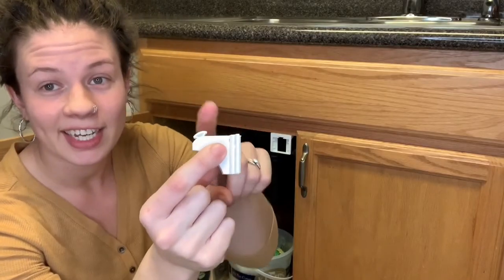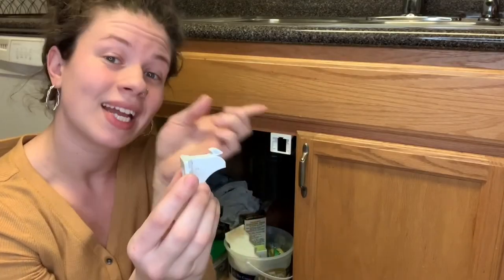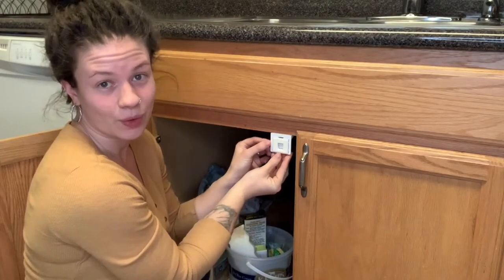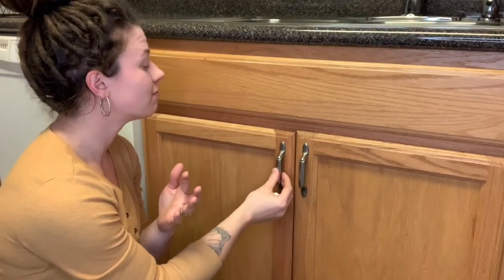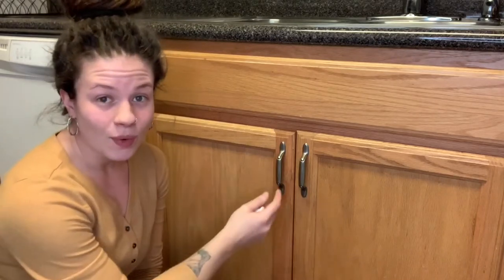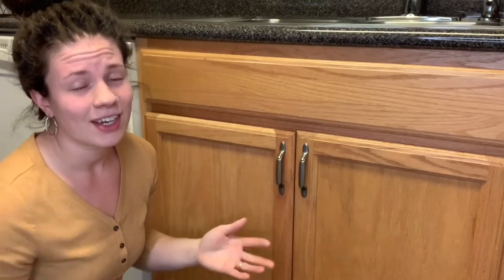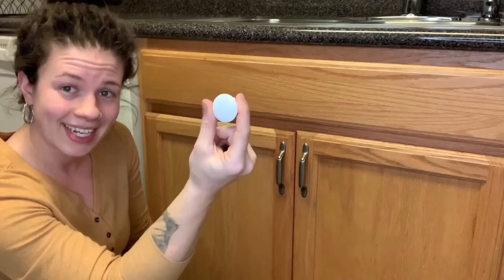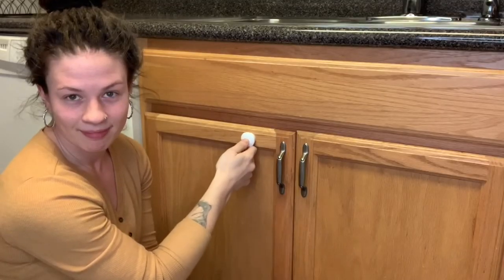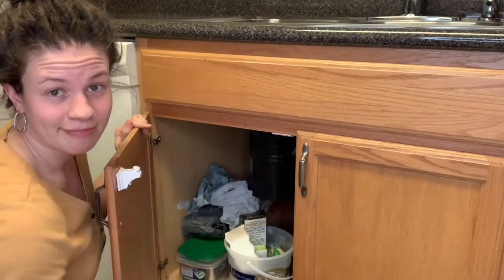Next I'm going to take one of my locks, making sure it is in the locked position. Remove the 3M adhesive cover, and then with that latch pointing up and into the cabinet, all I need to do is push the lock right into the empty square in the cradle. Close the door — and it stuck itself exactly where it was supposed to be on the door. Give your door a slight tug to make sure everything is aligned, but don't yank on it because you haven't pressed the adhesive in place yet. Take your magnet, put it over the top of the lock, and you'll know you're in the right place when you hear it click. Open the door, press your lock into place for 15 to 20 seconds, remove your cradle, and you're good to go.